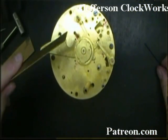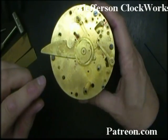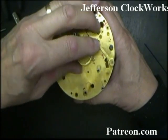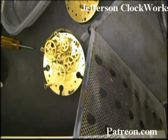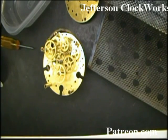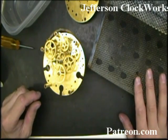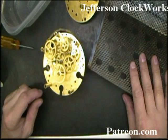I didn't find a piece of brass that was thin enough, so I decided to check how loose this cam is on here. I'm glad I did, because I can twist it — and off she comes. I have a little piece of metal, a part stand I made with holes in it, that fits right into my ultrasonic cleaner. It keeps the relationship of all the parts the same so you don't have to remember where everything goes. You just look at their arrangement inside this little standoff.